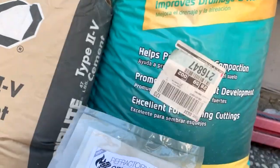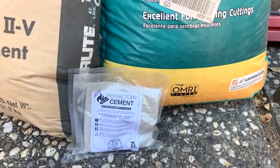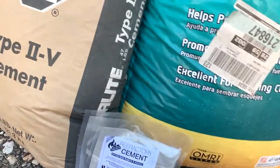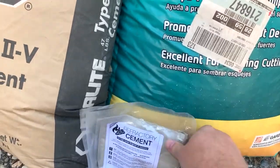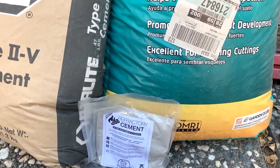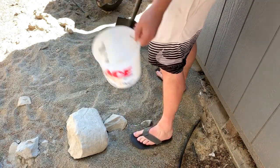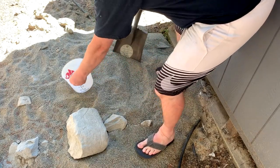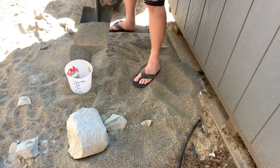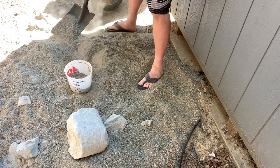And then I got some refractory cement — one pound. That's not very much, but I'm going to put that whole thing in. That is good for temperatures well above two thousand degrees Fahrenheit, which is right around what I'm aiming for. I'm using this two-and-a-half quart bucket as my measuring unit. Three measurements of sand — preferably cat-dooty-free, there is some dookie around — three measurements of perlite, so equal parts perlite and sand. Then one and a half parts Portland cement, and I'm just going to dump in the full pound of refractory cement.